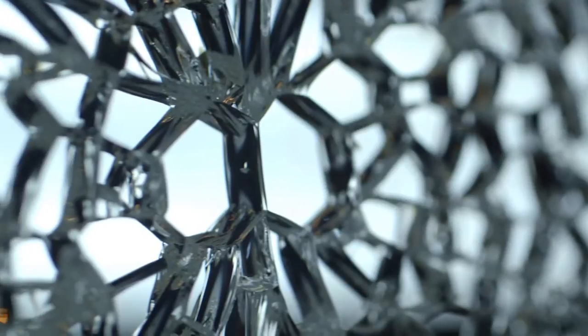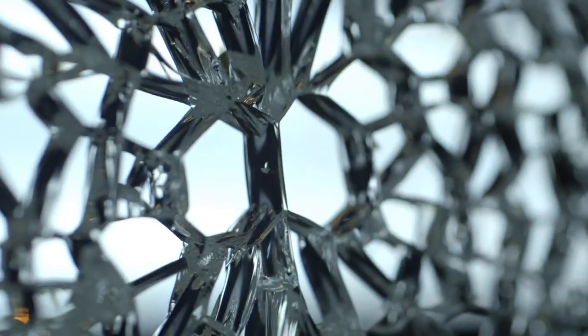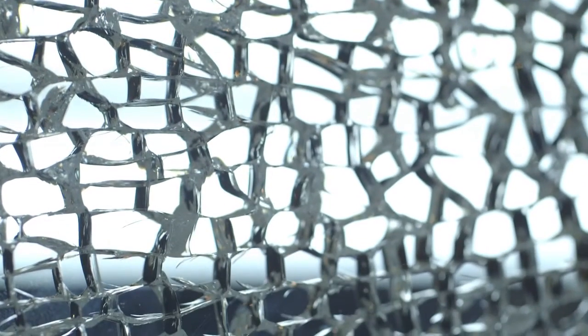When it does, the surrounding glass is subjected to an increasing tensile stress and can shatter the tempered glass. This breakage can occur without any load being applied to the glass at any time, even years after the glass has been tempered.